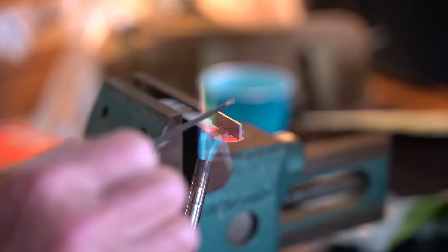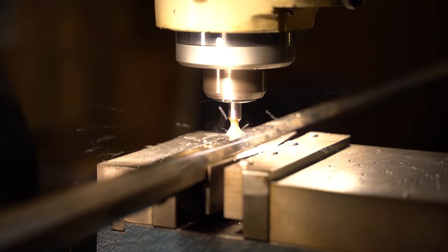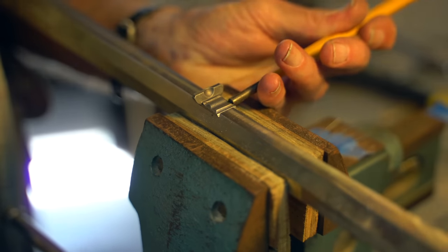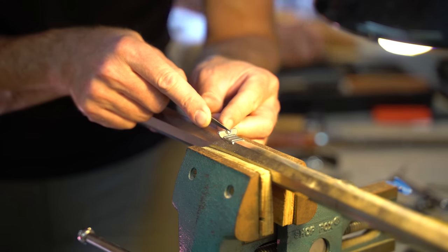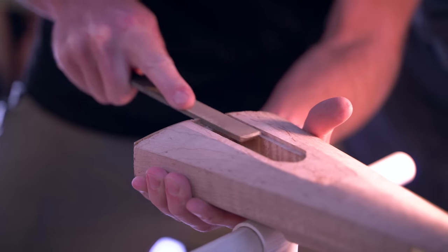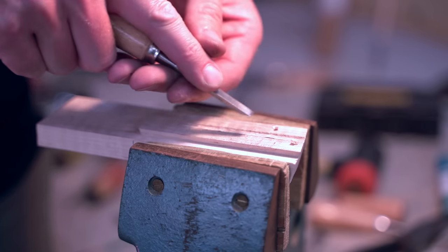Friday — down to the wire time to finish this thing out. Worked on the front sight: initially welding it in, then shaping it, then after some more hand filing, drifting that front sight into a dovetail. Then moving to the rear sight — filing it, making sure not too much material was removed, and drifting that in. Using a small jeweler's knife file, I filed the rear notch into the rear sight. Then it was time to cut the butt plate for the patch box: a series of tiny cuts, coming back with a file to remove more material until it was clean — making the lid for the patch box and inletting the latch so that when it slides into place it clicks and holds itself secure.